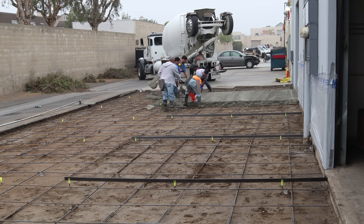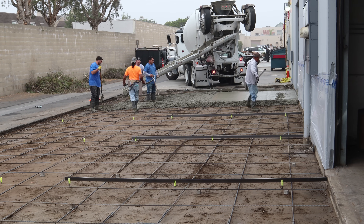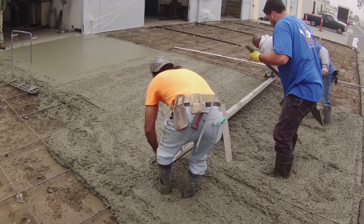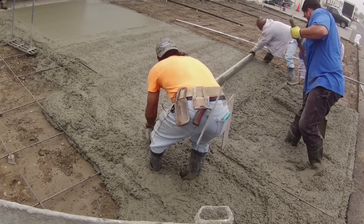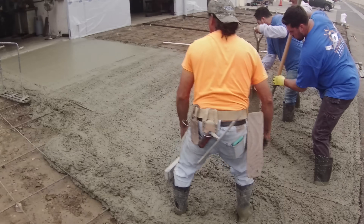We are using the screed portion of the system — those metal pieces. The rebar driven into the ground will stay in there; the plastic chairs that the steel sets in will just slide down onto the next chairs as we pour. This is a 3000 psi big rock mix. We initially started tamping the concrete but got away from that because this mix is good enough that you can just hit it with a bull float and all your rocks and cream come up.